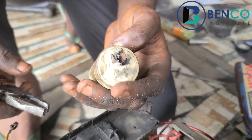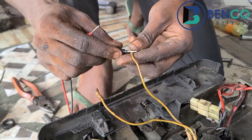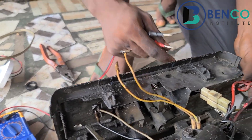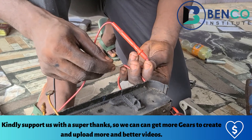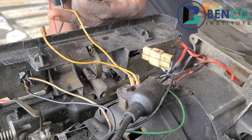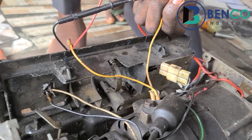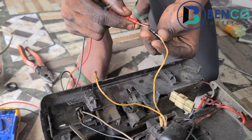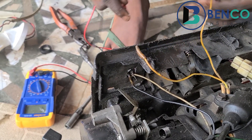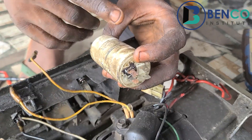I think the capacitor could be the issue, but let me quickly test for continuity in the exciter winding as well. The exciter winding is continuous. The output to the frame of the body — the meter doesn't read. The field windings to the exciter windings — the meter doesn't read either. But every other thing looks in place, so it's more likely the capacitor.